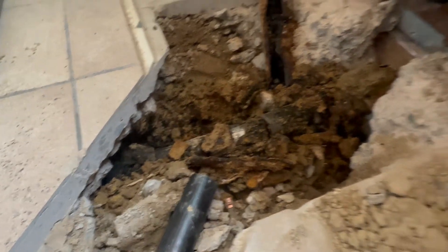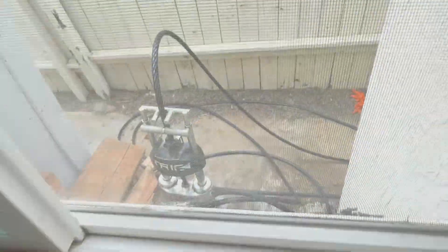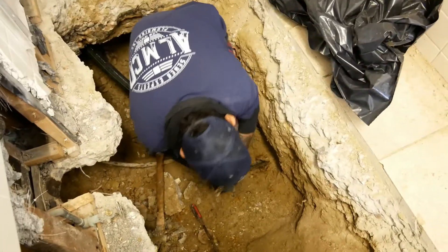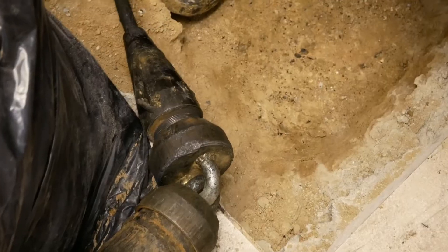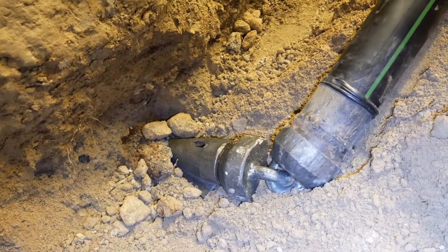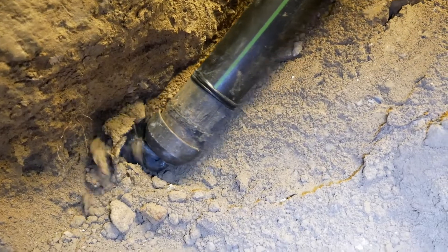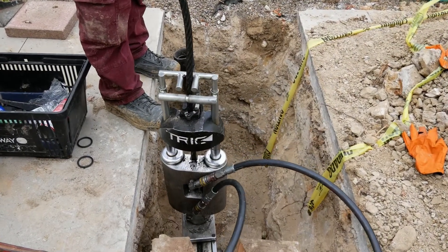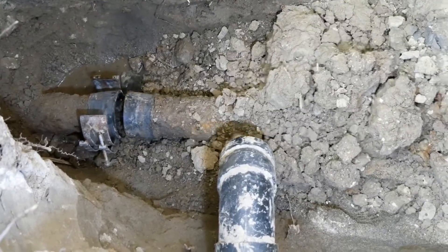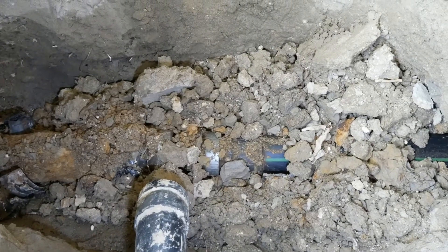Here's the process — here's the head. The head is here, we'll cut it over here and make all the connections we need. Here's the pipe from inside — you can see it's full of sludge and the pipe is dead. This is the equipment that allows us to pull the pipe through. This is the start of the process for the three-inch mainline pipe bursting. We connected the head, pulled the cable from one side of the house to the other. The equipment pulls the head — you can see it makes a 90-degree turn — it breaks the old pipe and replaces it with the new one. We also have a Y connection for the other bathroom — we remove the ABS Y, crack the old pipe, break it completely, destroy it, and bring a new one in the same place.